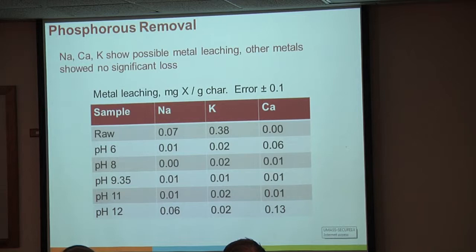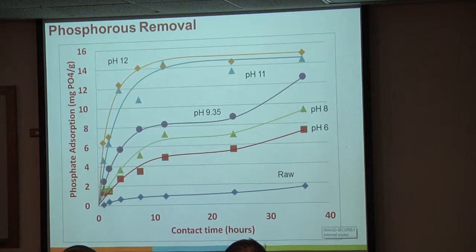When we look at phosphorus removal, our raw untreated char gives about 0.1% by-weight phosphate removal relative to the input of char—so for every gram of phosphate in solution, you'd need a kilogram of char, which is not a great filtration option. When we look at higher pH materials with a lot of calcium, we're talking about more than 1.5% range, which looks more feasible. And importantly, at about pH 9.5—more feasible to reach on the farm without adding a strong base—we still got good removal, almost reaching 1%.